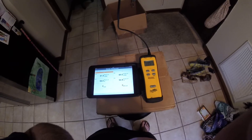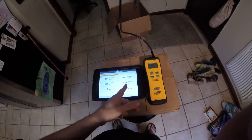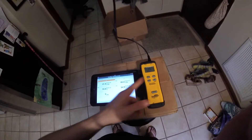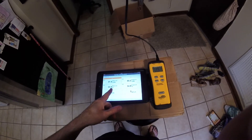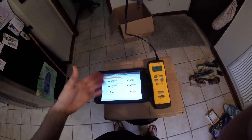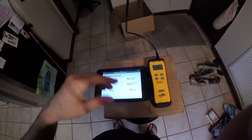If anything changes, I'll pick it back up. Now we're within about 0.4 between the supply plenum and inside the flex — 0.5, 0.6, half a degree or so — deep in the flex to the face of the grill.